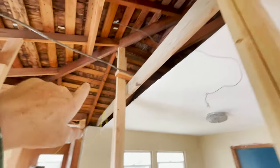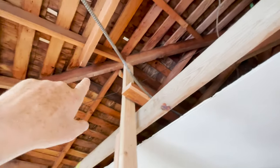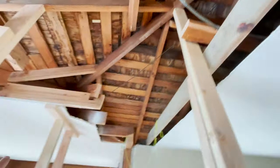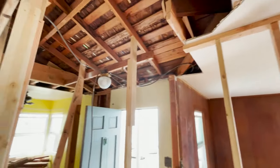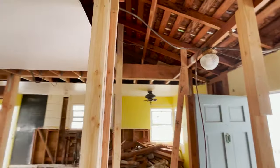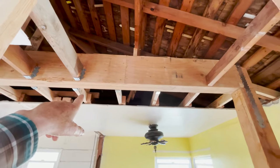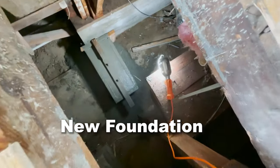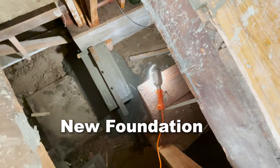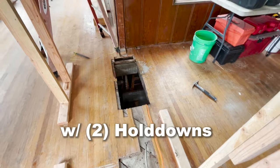That way left standing, one ceiling joist here. And you can see up here we braced up to the roof temporarily so this doesn't drop. So this is all clear. We're ready to put another 6x12, and we'll put a hanger right over here and then a post coming down to here. The footing is already poured down here with two hold down anchor bolts for two hold downs.